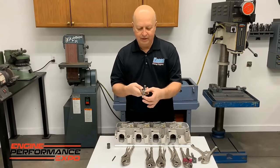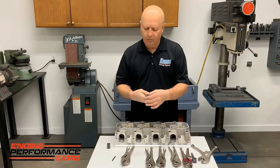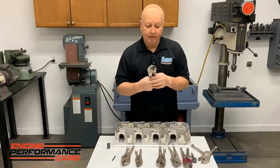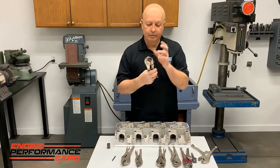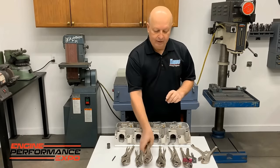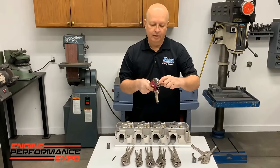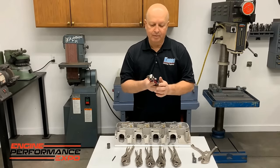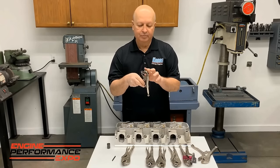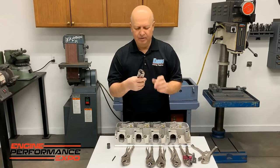The one thing I would say, if you're going to make your own: this one here is for 5/16, and I used a union nut on it. The union nut's not quite strong enough. It'll work, but it's not as good. It's better if you make a piece of bar stock, drill it and tap it either in a drill press or lathe, and then weld it and cut it in half. The bigger it is, the stronger it is, the more distance it'll have for the threads, and the better it will work. Where I used the split nuts, just because I didn't feel like doing the lathe work that day, they don't work near as good.